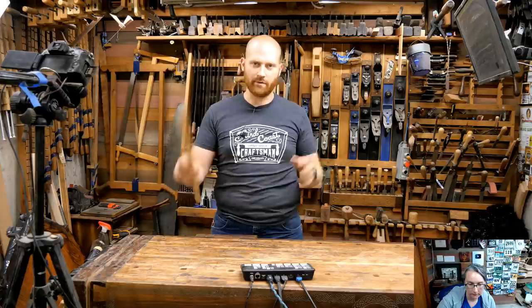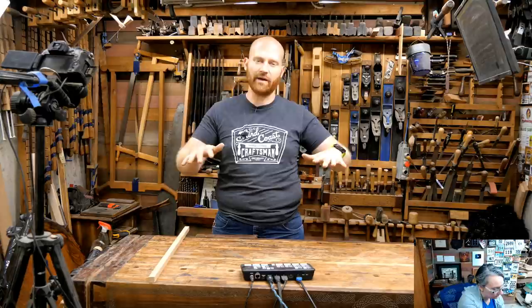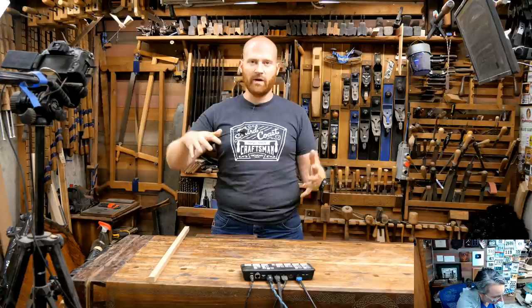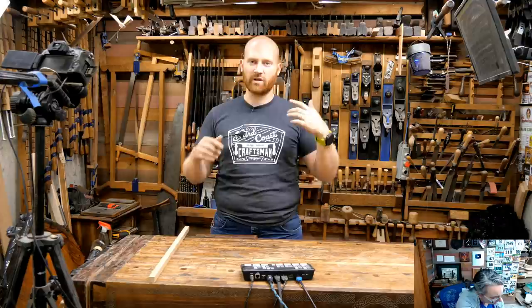But if you are in an outside space or in a garage that's not air conditioned, where you have air flowing or humidity and temperature changes, your wood is going to expand and contract. If you stack it all up in a pile, the outside surfaces and the top of the pile are going to be affected by the weather change much faster because they have open surfaces. If you separate everything with stickers, then all of the surfaces will have air getting to them, so that all of the surfaces expand and contract together, and your boards aren't warping and changing as much.